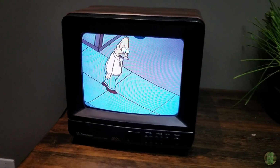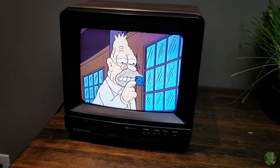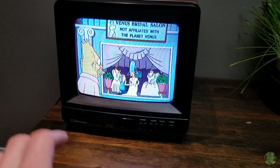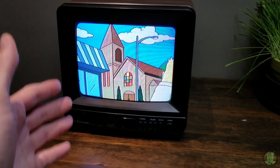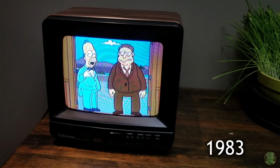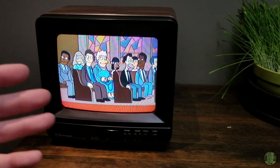Some channels seem to get interference from outside, like maybe there isn't a TV channel on there, but something out there is causing UHF interference. And when I go to the higher numbers, there's lots of noise. And I was doing some reading, and I guess originally UHF in North America was channel 14 to 83. And I think sometime in the late 70s or 80s, they shrunk those down to be channels 14 to 69 and then used the higher channels for things like cell phones when they started to come out and communication.